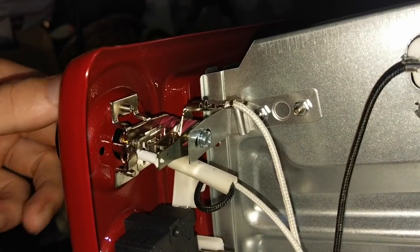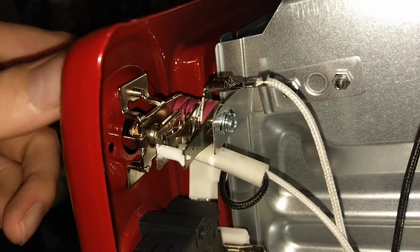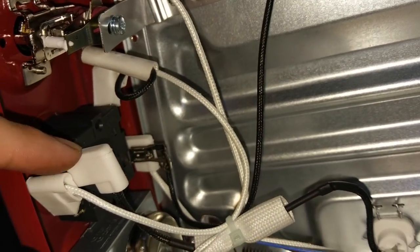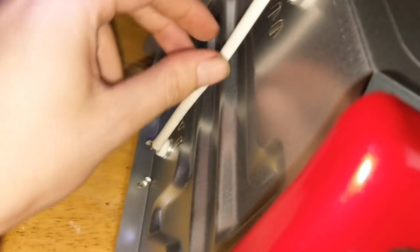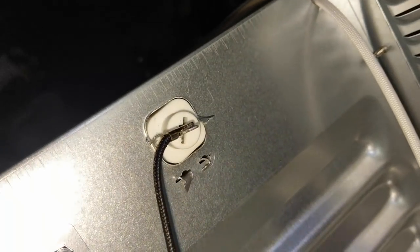You can see everything behind the switches — we've got our temperature knob over here. I was always curious how this thing works. It's some kind of weird metallic heat-sensing mechanism — really interesting. We've got the timer module which acts as a switch, and the little bell which is completely mechanical. It shares a common ground between the two heater elements. The issue is the heater modules were bent and tacked in place, so they're not very easily replaceable.